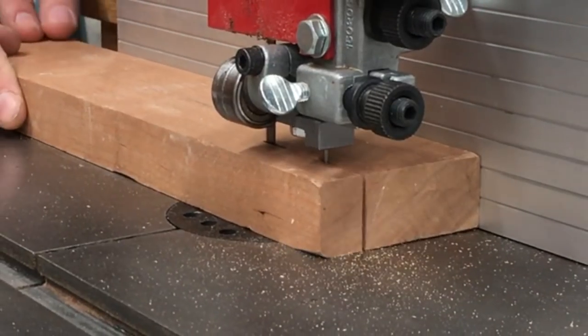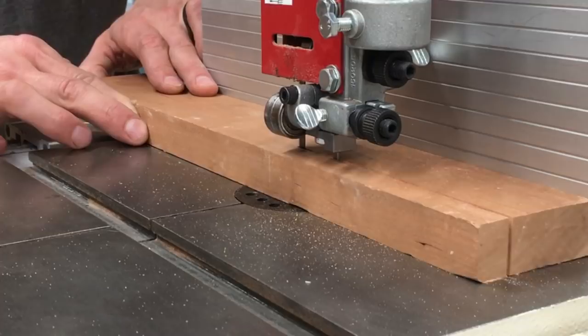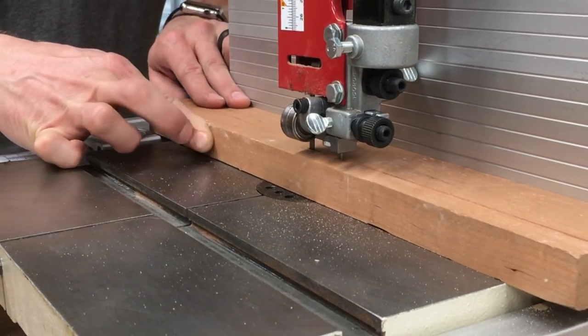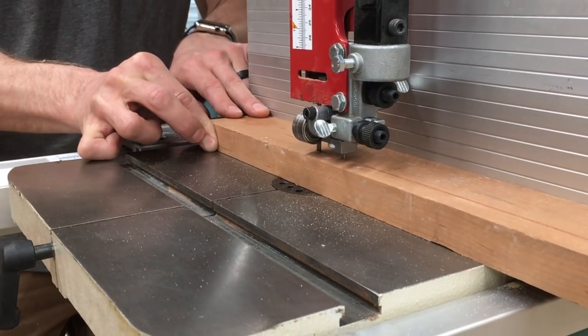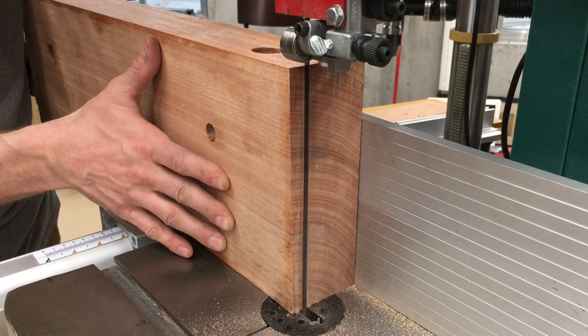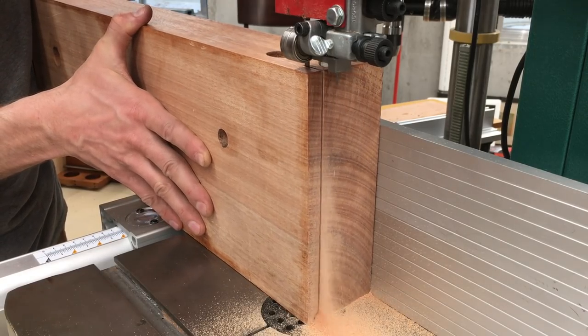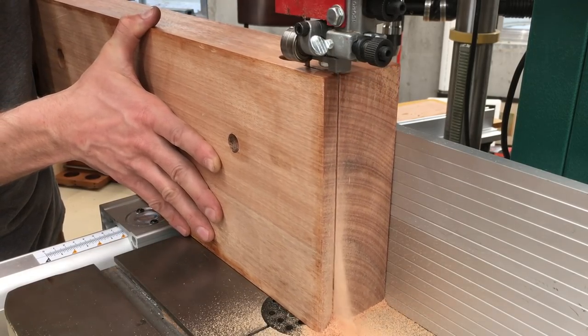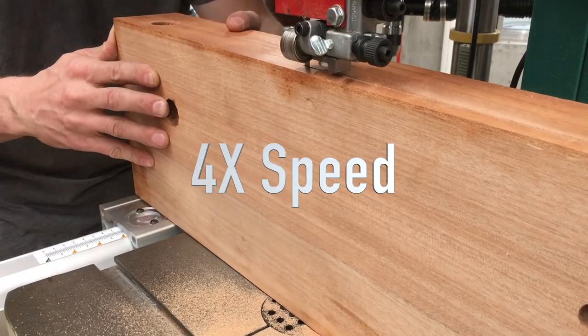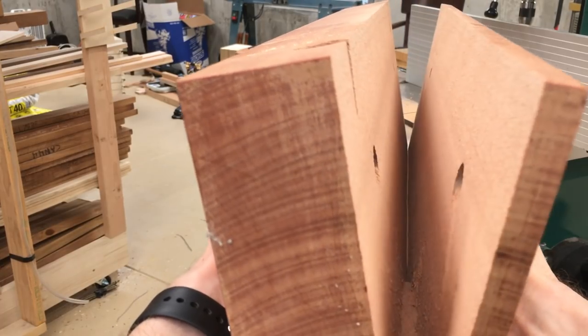With both pins in place, the guide pins keep the workpiece really straight and actually give a snugger fit in the cut than the back of a thick blade would. Even on a large workpiece I can do resawing — this is about eight inches of mahogany — and it resawed very well. I got a really nice straight cut.